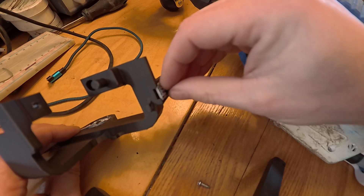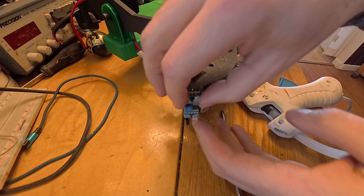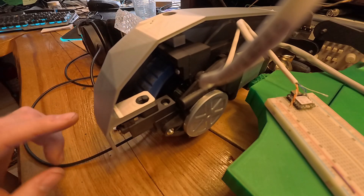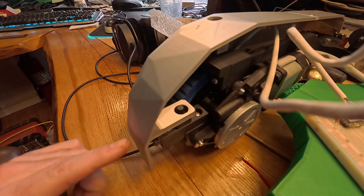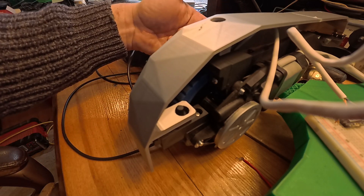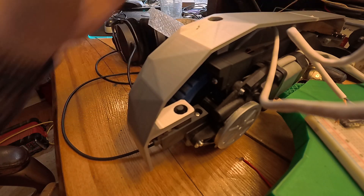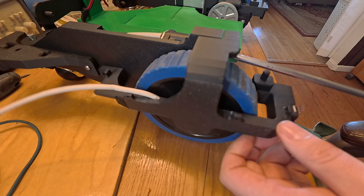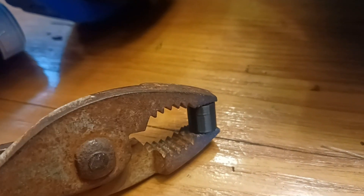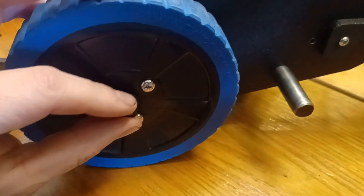With these decisions made, I started to mount all the sensors, putting them in their proper places — and yes, holding some of them down with hot glue. It works perfectly well; don't judge me, this is still a prototype. I'm not completely happy with the fit of this fender, though it's also just an initial prototype. It'll get nicer looking, but I also have to make it move a bit more freely, or add some return springs so it can't stick and continue to think it's hitting something when it really isn't. The magnetometers, which I'm using for odometry from the drive wheels, were also too far away to sense the magnet I had simply stuck on the end of the motor shaft. So I 3D printed some little holders that would hold the magnet much closer, then tested it to make sure the magnet was centered. I found that if the magnet is offset, the output from the chip becomes somewhat elliptical — the counts tick by quicker at some parts in the rotation than others.